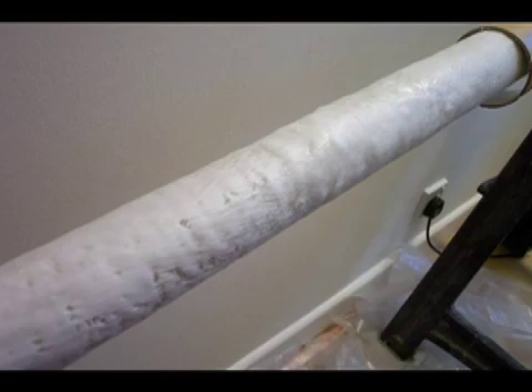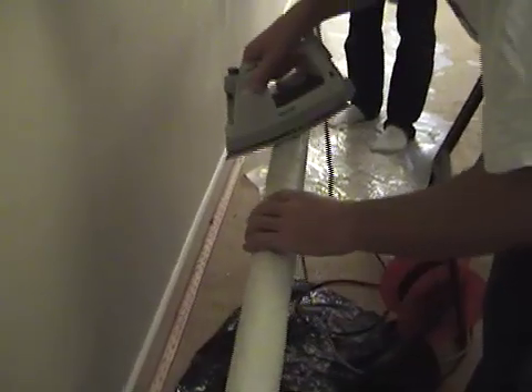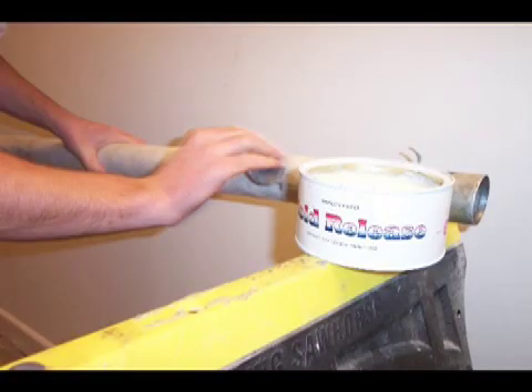When you've coated it with enough wax, you'll find that it's quite a rough surface, as you can see here, so you'll need a method of smoothing it. We've found that using an iron is the best way of doing this — set it on a very low heat. After it is as flat as you can get with your iron, use mould release wax to fill in any small defects.